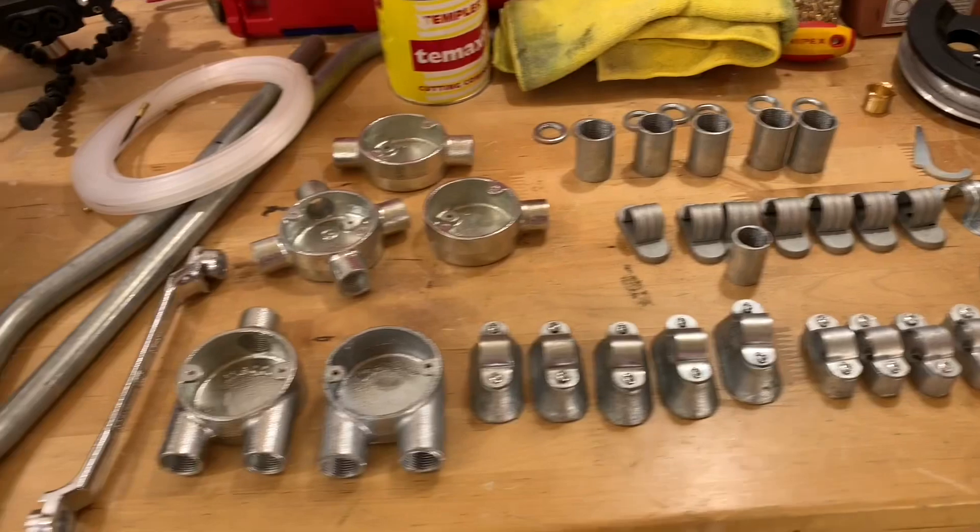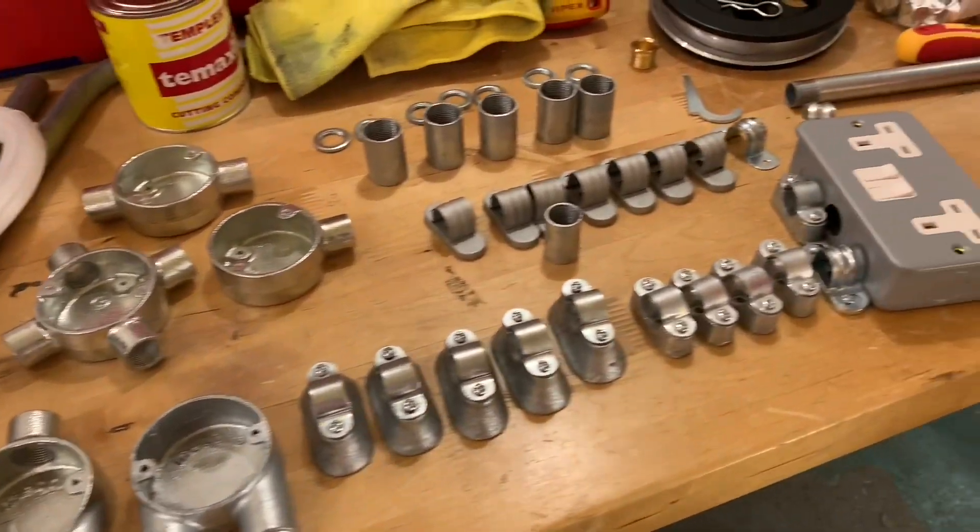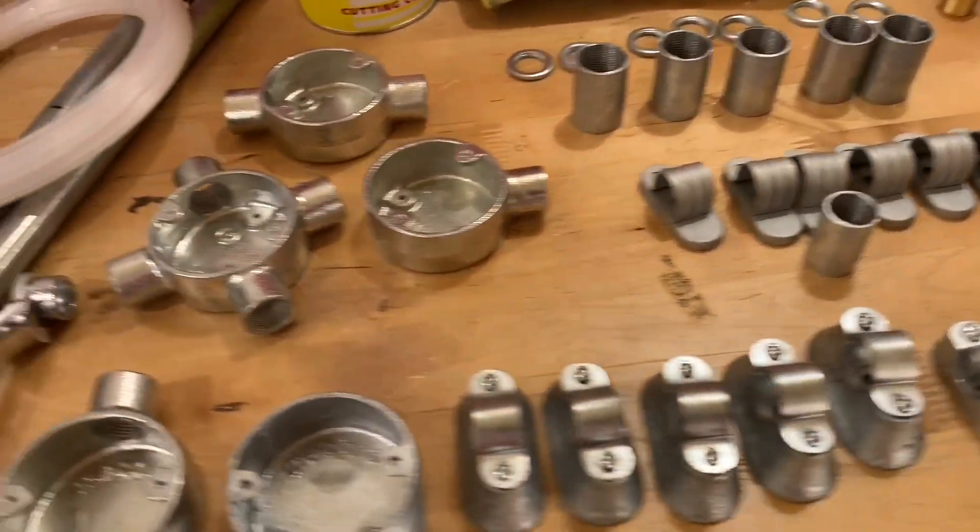So that covers the common fixings and boxes in the electrical industry — and these could definitely come up on a multi-choice exam. The range we've looked at today is galvanized steel, but in high hygiene areas stainless steel would normally be used, alongside a stainless steel hospital saddle and conduit. In the next video we'll look at accessories and start looking at stocks and dies, leading to Jake producing the perfect thread on a piece of steel conduit. Leave your comments below if you've called any of these boxes something different, or if there's anything else you'd like us to tackle in this series.